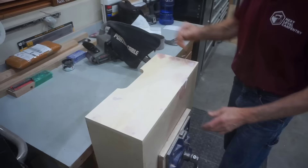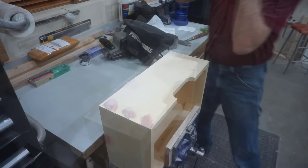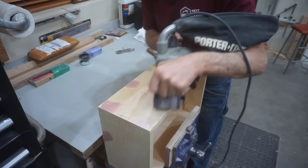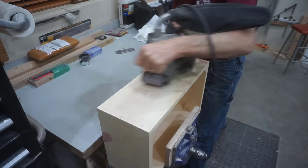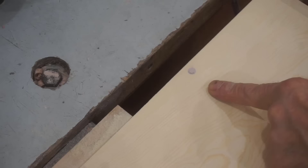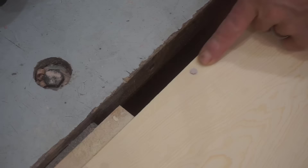I use a slow belt feed to remove the excess filler so that the only filler left is what's filling the defects. Now I can pull off my masking tape form and go to work. You can see how this belt sanding action quickly removes all the filler except what's left in the defects. If you want to learn more about handling a belt sander, click the link in the upper right corner. It's important that the work piece be clamped firmly so the belt sander doesn't toss it across the room. I keep the belt sander on the main flat surface so the surface remains flat while sanding.